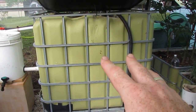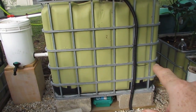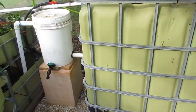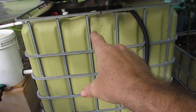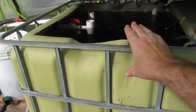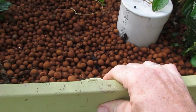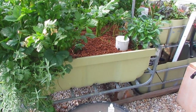Just quickly on how our beds are set up and how the IBCs are cut — a lot of people just cut, flip the lid over and have a grow bed and a sump at the bottom. I did that for the sump tank: one IBC, made a cut, flipped the top over into a grow bed, and the bottom is the sump tank, partially buried in the ground. With these grow beds I went a different path — I cut the side off all the way around so I can use the cage to get the grow bed to sit on it. I made up a bracket, pop-riveted it onto the frame, and screwed a piece of timber along the front. It's been primed and painted so it's weatherproof and the grow bed leans against that so it won't bend out. It was a really cheap little build.